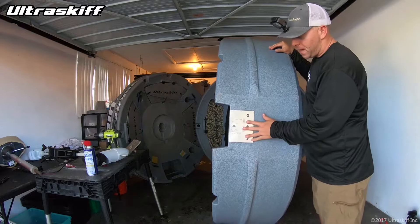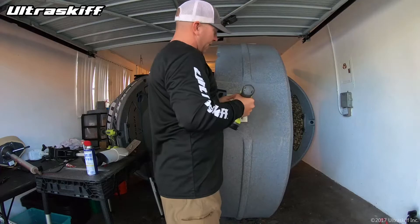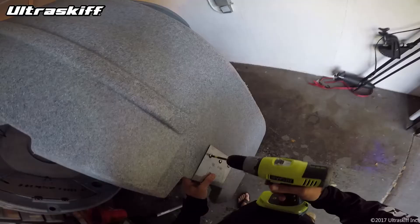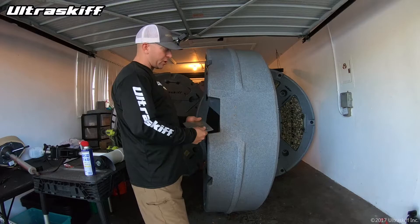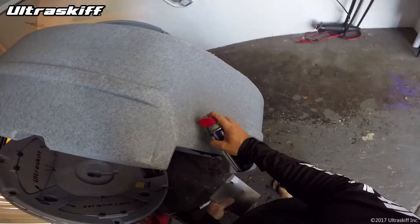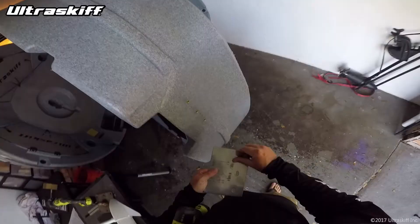The transom bolts can also loosen from motor vibration during use. It's a rarity but definitely something to keep an eye out for. If you take off a plate and there's any dirt or mud in there, wash it off. All these inserts are either stainless or brass, so you don't really have to apply WD-40, but it doesn't hurt. Then pop it back on.